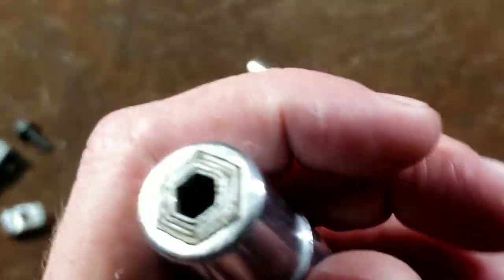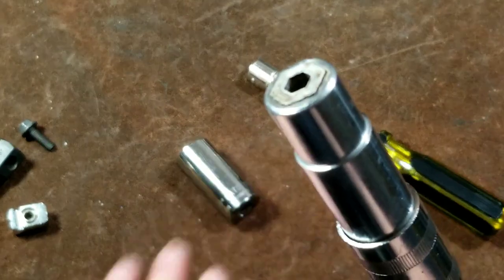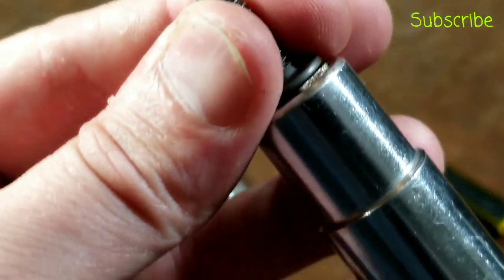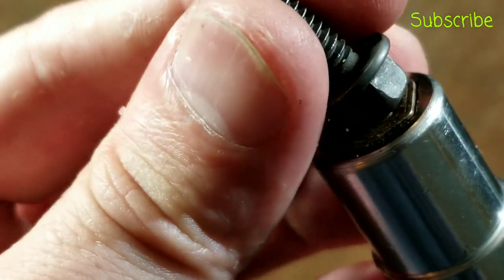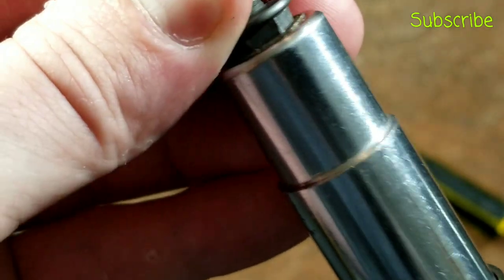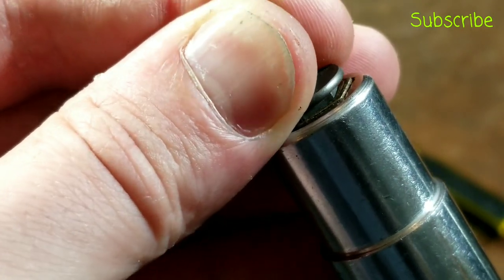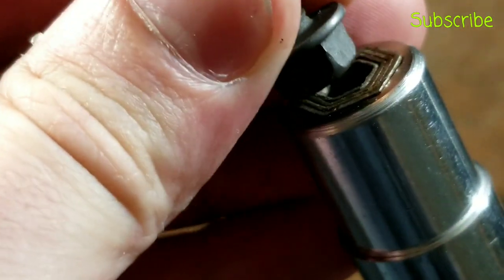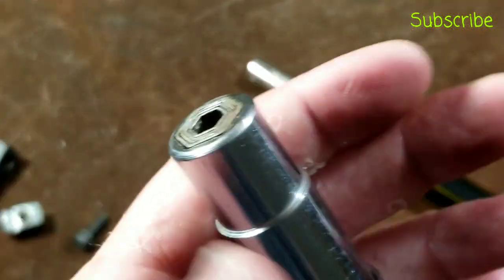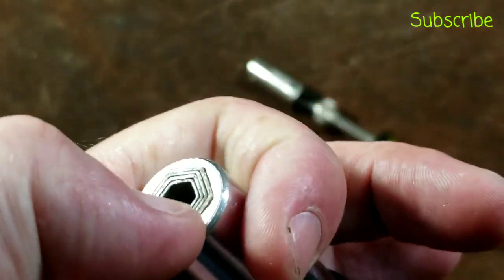Here's our second design, which is actually one of the worst. It's a series of sleeves, so it won't work equally well on both metric and imperial fasteners like the other two — it really only works very well on imperial fasteners. Another disadvantage is that if you're offset it just won't turn at all, so you're constantly pushing it on until you can get the fastener to cooperate and press down on just the right sleeve. Then it'll drive the fastener, but as you use it the little sleeves get beat up and stick to each other, becoming less and less useful over time.